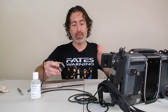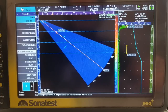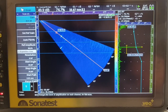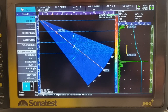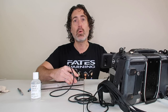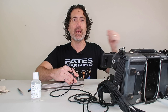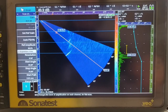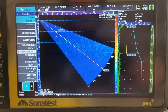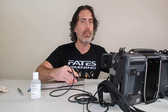I'll do a little demonstration to show you the effectiveness of the end cut. Here I'm putting it on the three-quarter-inch step — you can see I've got a first leg, second leg, and third leg hole signal but no corner trap, even though the position of the hole is quite close to the end of the block. Now if I rotate the probe you will see the corner trap signal come back in again — there it is — but in position to hit the hole I see nothing.